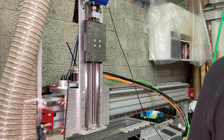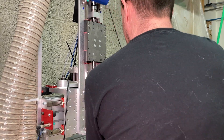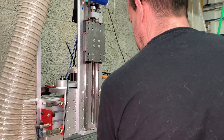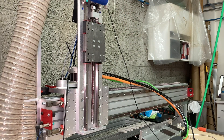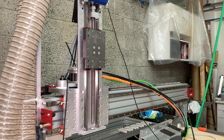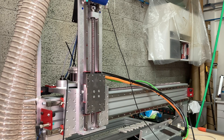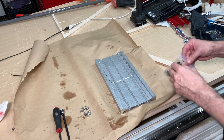Putting the Z-axis back on was actually a lot easier than taking it off. I basically held it in one hand with a screw through one of the holes, and that was enough to guide it into place and get that first screw set. Then it was just a matter of putting the rest of the screws in and torquing them to the right amount, then reinstalling the brake and servo and running it through some tests. After satisfying myself that it was working correctly, I reassembled everything and remounted the spindle.